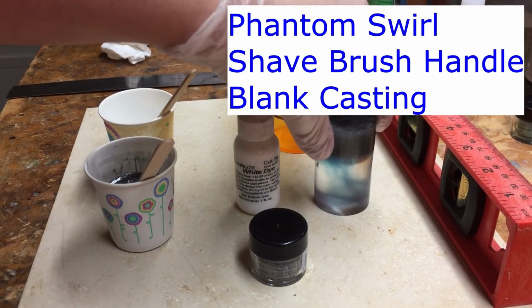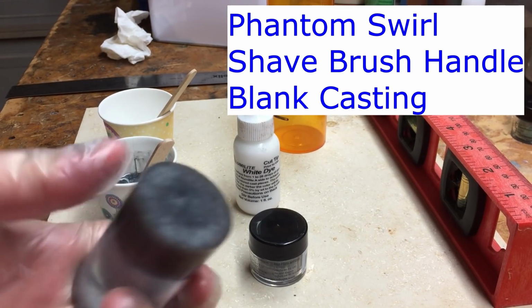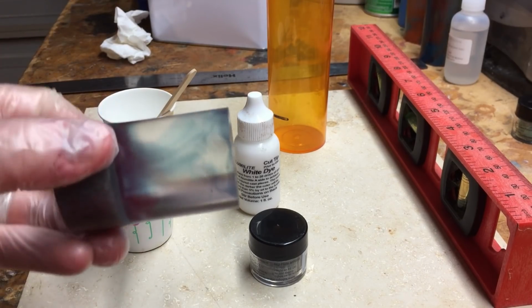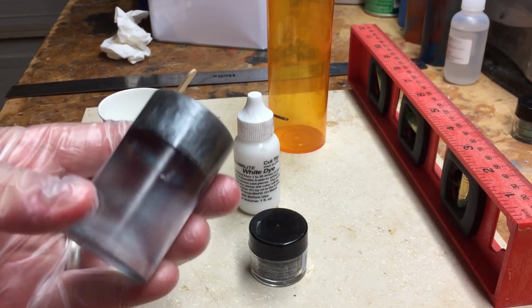I'm gonna cast a new blank here. This is gonna end up looking kind of like this one. So it's got a solid top. That's where you're gonna fit the knot for the shave brush, and then the bottom is gonna be clear with a little bit of swirl of another color in it. So we're gonna go opaque and translucent with this one.